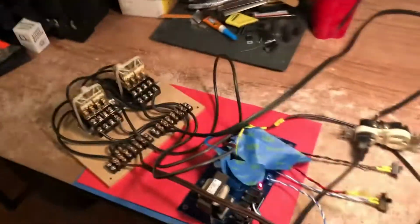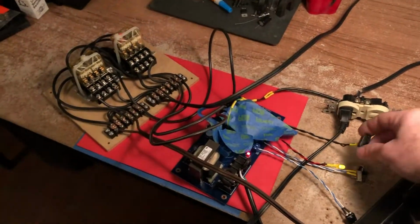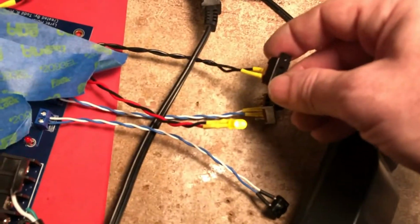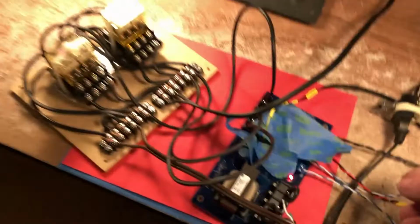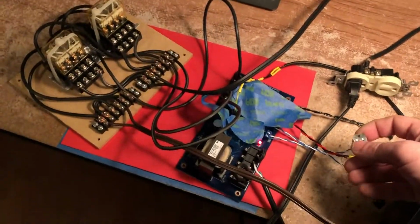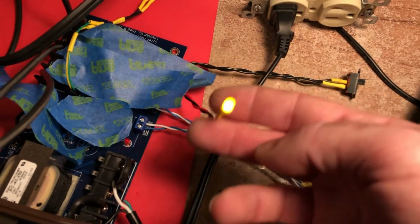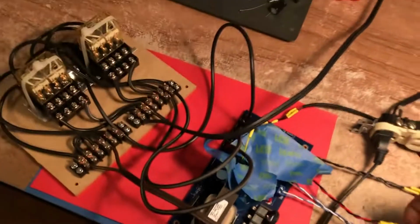Right, and so if I do this and I switch speeds, of course, the lamp's going to go out. But the other relay is on, you can tell that, and the motor is still on. If I was to switch back speeds, the lamp turns on. Now if I simulate hitting the start button right now, the lamp turns off. But the motor is still saying, I'm on still. You haven't turned me off, you just hit start.